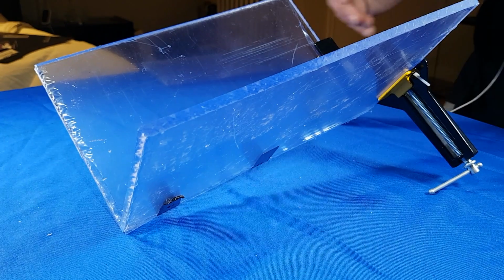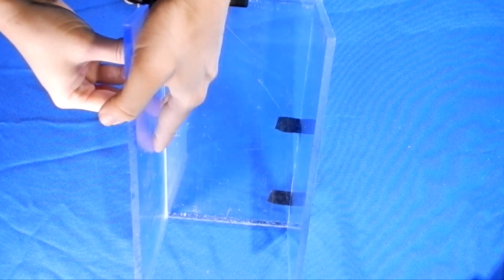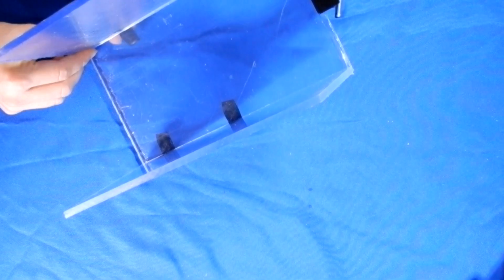Side by side, continue with the same process. Take your time. You should let each side cure for at least 5 minutes before touching it. If you don't allow enough time for your edges to cure, the cement will drip and again ruin your edges.